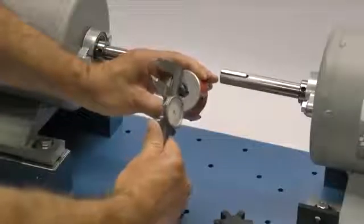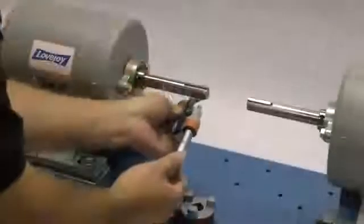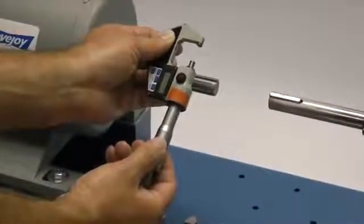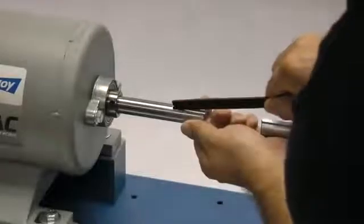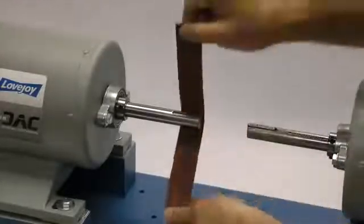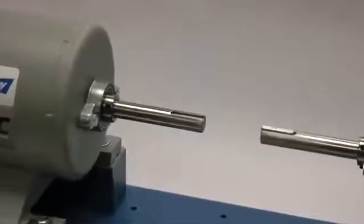You may want to check the bore size for accuracy prior to continuing with the installation. Measure the shaft and ensure that the shaft diameter matches the coupling bore size. Then inspect the shaft and clean off any nicks or burrs from the keyway or shaft diameter. A fine-toothed file can be used to clean burrs from the edge of the keyway or large dents in the shaft. The emery paper can be used to clear the shaft of rust or any fretting corrosion.